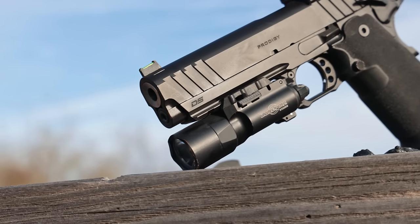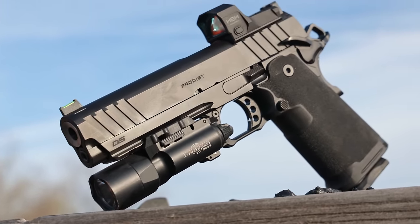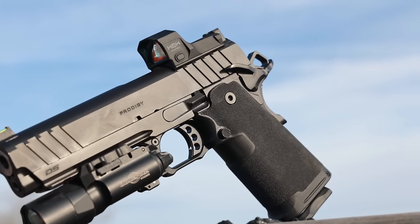That is something really common not only on 1911s and other hammer-fired pistols, but even striker-fire guns as well. One of the first things people will tell you if you want to make your Glock trigger better: go put a lot of rounds through it so all of the parts burnish into each other — that's an actual process these things go through. Those of us out there with multiple pistols from multiple brands with thousands of rounds through them can definitely notice a difference from round one to round 5,000. All pistols, or pretty much any mechanical device, will follow that trait pattern. Yes, 1911s or 2011s may take a little bit more break-in, but pretty much everything out there is going to get better with time until you start to wear it out.